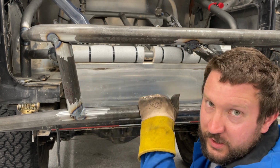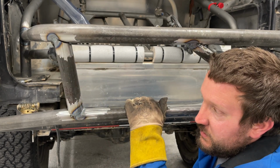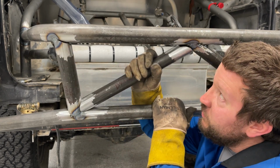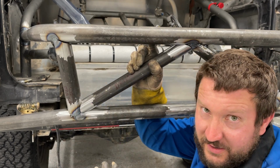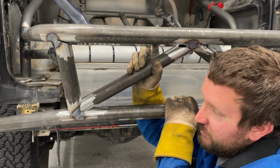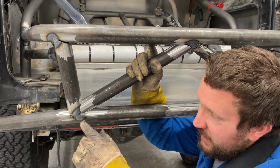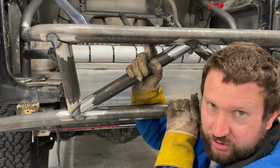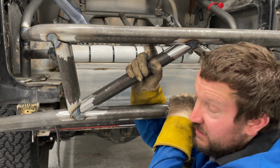this tube has weld all around it in all directions before the next tube is fit up and welded to it. So what you're seeing here is the fast version, where I have already done the welding in the section that I'm going to put the next tube. So then I can do the welding of this tube in place and not worry about the weld that's underneath. It's already done. That way I can finish welding this thing out like this thing was never there at all.